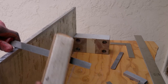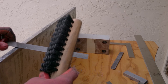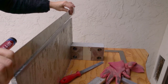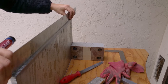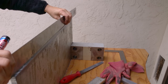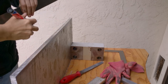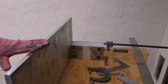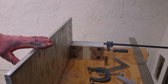The problem with the oil is it makes the chips kind of hang on the file. Almost like scraping, you can kind of feel hinge points. There's a hinge point right here, so I can mark that. I feel my proclivity is to round this edge. What I did is I clamped a block of metal onto a file, and the idea is I could take this and keep this against the metal so I don't round it as much.